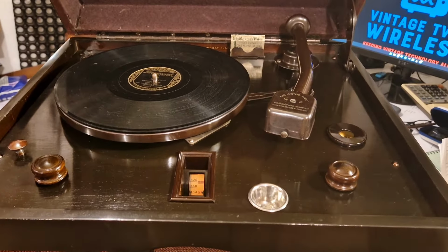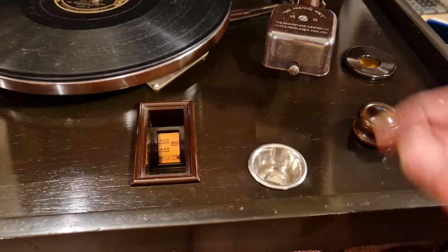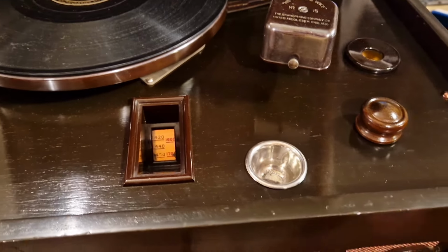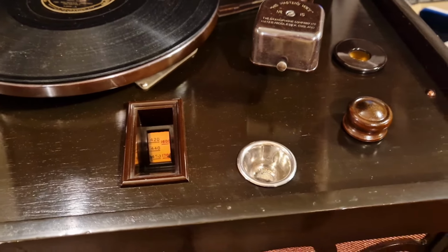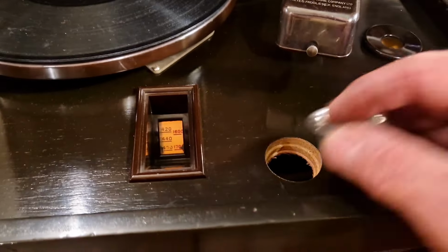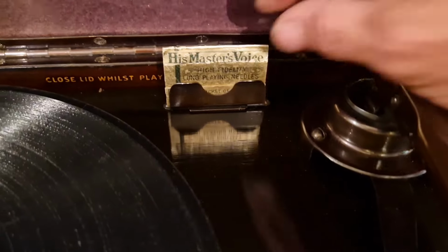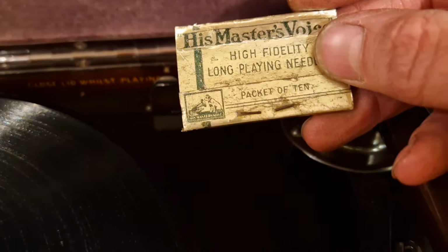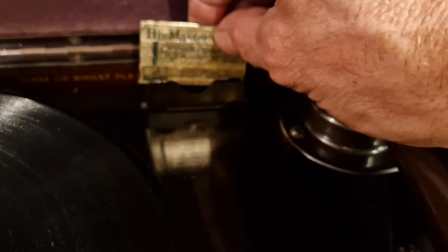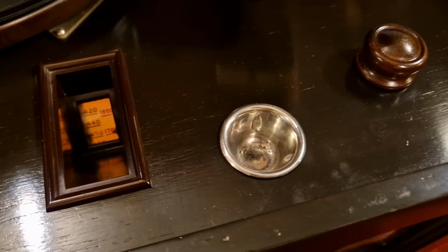Anyway, just turn it down for now. As I mentioned before, there was that horrible hole in the front, that keyway, where someone had put another volume control on it. I don't know why, because the one in here now we've restored works fine. But this looks much better. It's one of these little cups you could load up with new needles, because obviously you need to replace them. I've popped a pack of the original HMV long play needles in there to make it look pretty, but they're going to be quite hard to come by now, so what you need to do is fill this little cup up here with new needles,